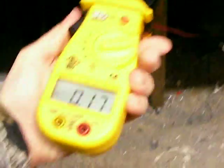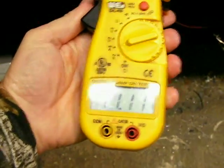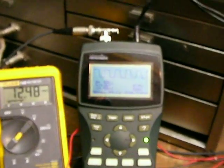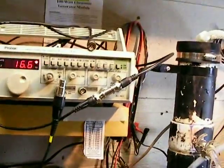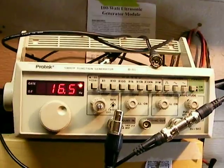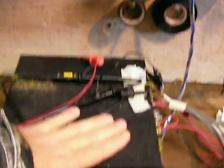Yeah, 11 amps — that's all it's running at: 11 amps at 12.48 volts. My input is 21.52 volts on the square wave frequency. I can change the frequency; I'm running at 16.6, which I'll knock down a bit to 16.5. The modules are staying real cool.